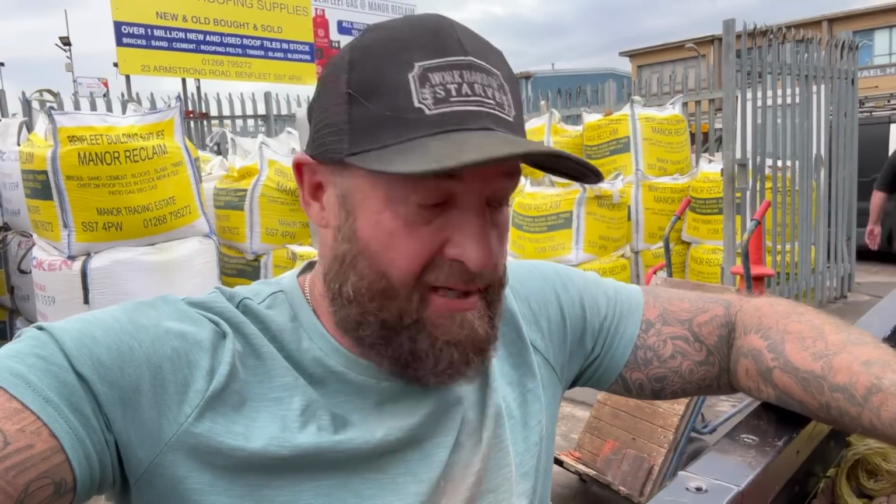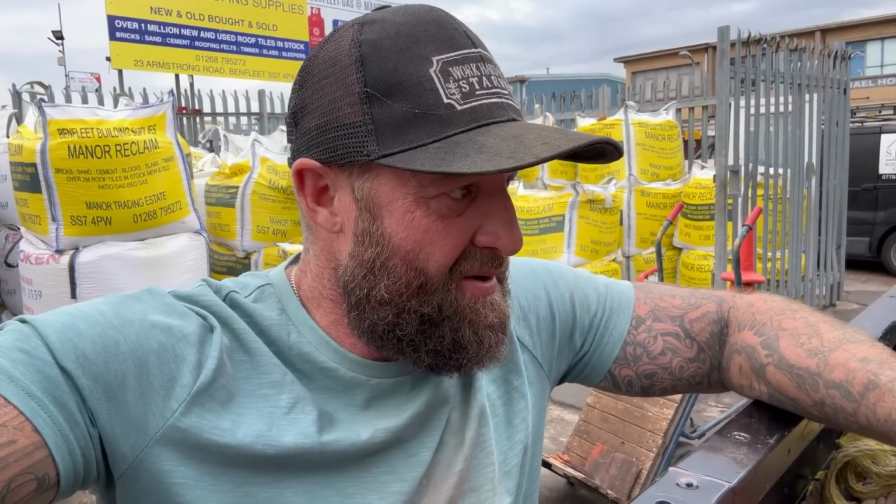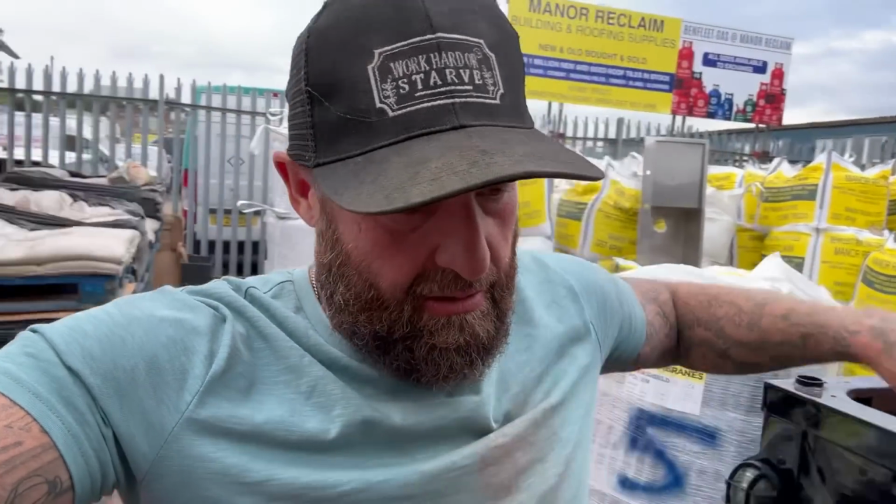Boys at the job now, finishing the last bits of demolition, taking down and prep work. And then this afternoon we're going to set a plan out. Sammy boy will be cutting the closures, snap headers on the stocks, and some three-quarters. So we're all ready, so that'll be loaded with a plan of action for laying tomorrow. Lime, sand, white cement to turn up this afternoon. So that will be us, everything in sync, ready to go.